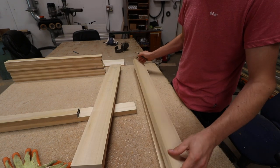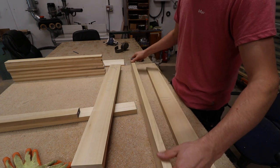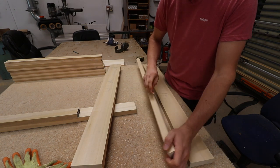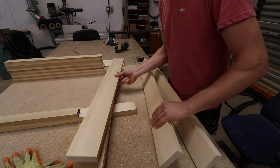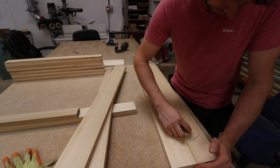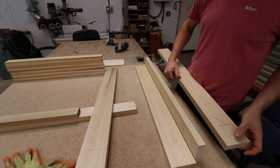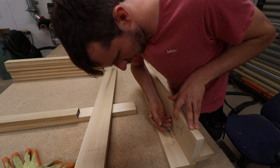We're left with two face pieces here. I want a nice clean back edge on each. Now I can glue these together and make some corners. So if we call this number one and this one number two, that will make this the top. We've got a pair with a top orientation — a side here and the top — so that'll be joined onto this one, number two. I'm just going to domino them together, sit that one against there, take some appropriate lines down, stick some dominoes in there and joint that together.